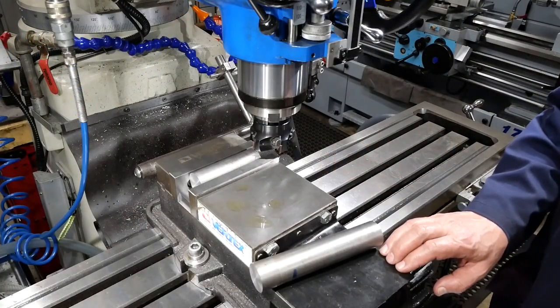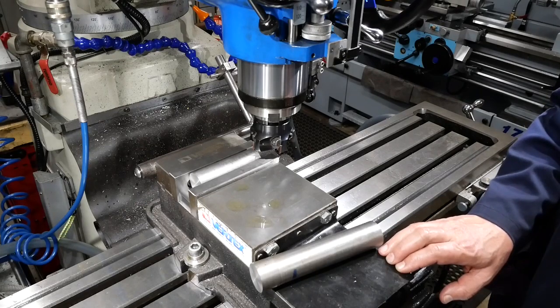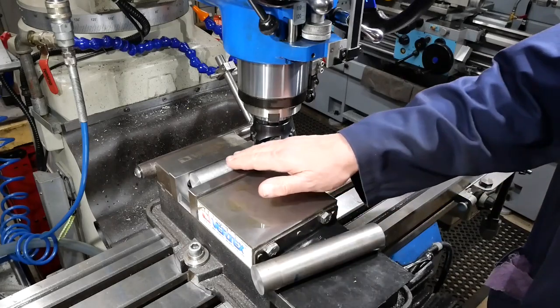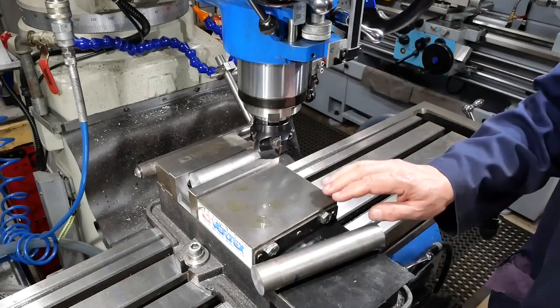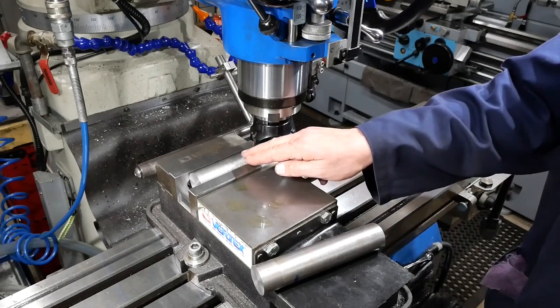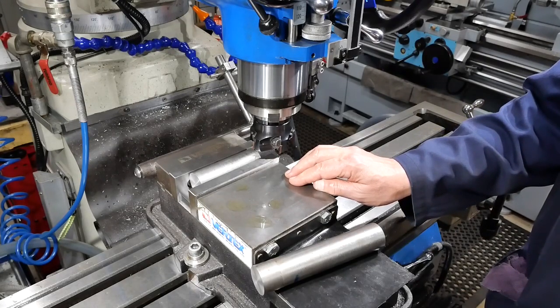The external dimensions of the pieces that I want to make are 30 millimetres wide and 20 thick, as I look at it, and 54 millimetres long. Well, I don't have any flat or square bar stock that is appropriate for that, but I did have this chunk of 36.5 diameter round bar, and I've hacked a piece 100 or 110 long, which is in the vise. And basically, according to my trigonometry, if I take 8.25 off one pair of sides and 3.25 off the other pair, I should finish up with what I'm looking for.